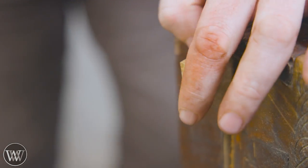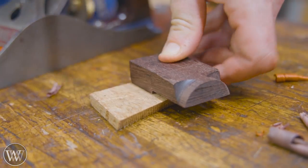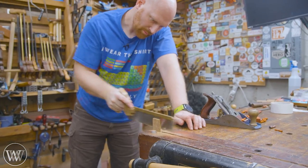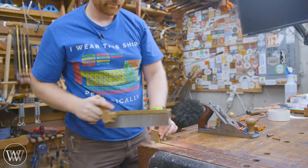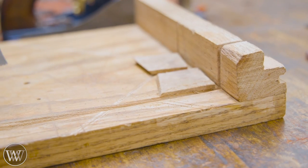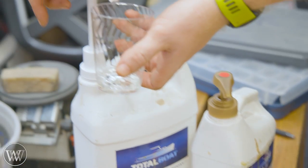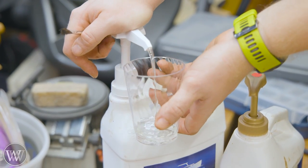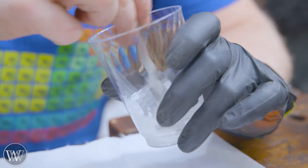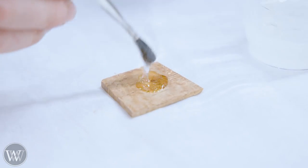This is a tiny piece of wild curly white oak — one of the last couple pieces I had from that board — and I absolutely love it. It has so much detail in the grain that even on something small like this, you'll still be able to see the grain coming through. We're going to re-saw this down the middle and this will give us two pieces. For the glue, we're going to be using epoxy because they were stabilized — there's resin inside and the epoxy will hold it better. Plus, epoxy is one of the strongest, longest lasting glues, so this will give it the absolute best chance.